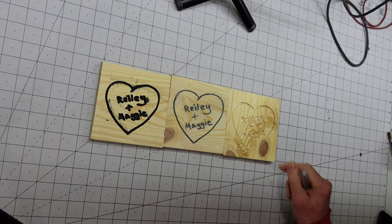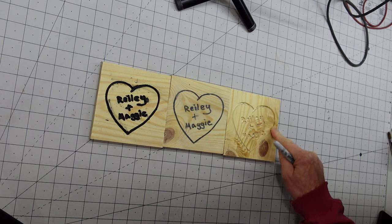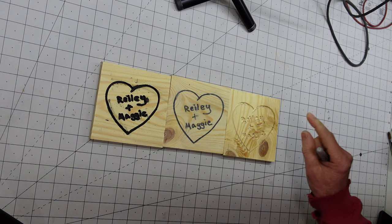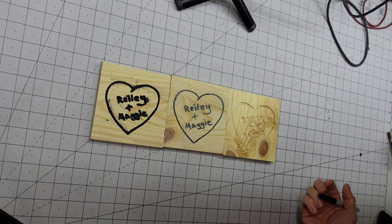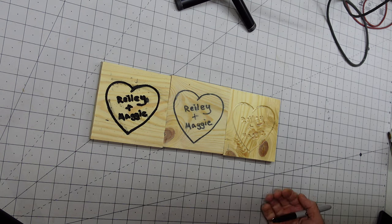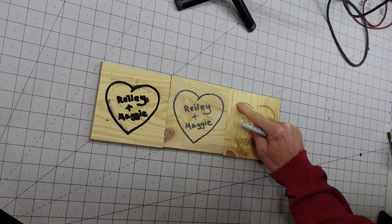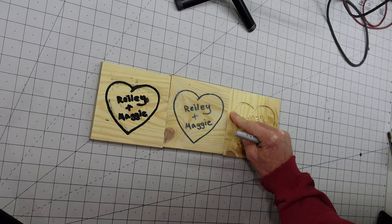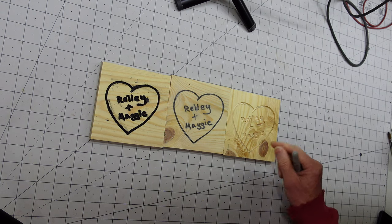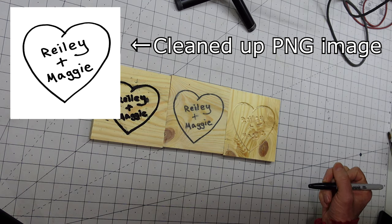This is the third attempt. This is a single 3 millimeter pass. It was probably at the limits of the machine. So if you're using a stock machine, you may want to consider scaling that back a bit. I was starting to get a bit of chatter when it started on each new tool path. Essentially each new carve, I'd get a bit of chatter until the bit got into the groove and got working along.